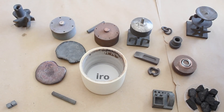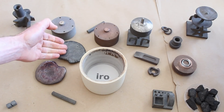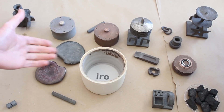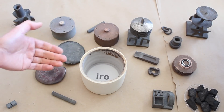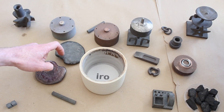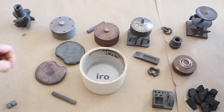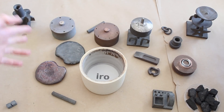People have been asking: can I print with mild steel? Yes, you can. If you take a filler metal that instead of 4% has a lower carbon content, like 2%, then you would end up with about 1% carbon in your print. But to melt a 2% carbon filler metal, you would need a much higher temperature kiln, and if it's 1% then even higher. So yes, you can, you just need a different kiln.